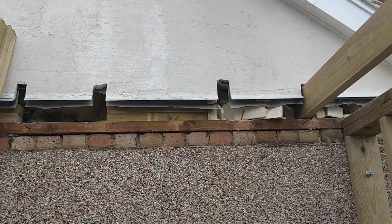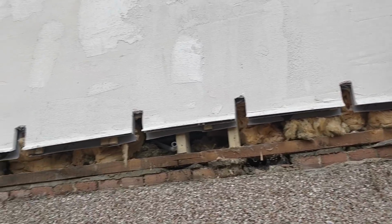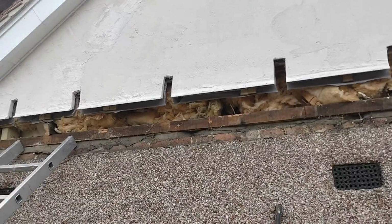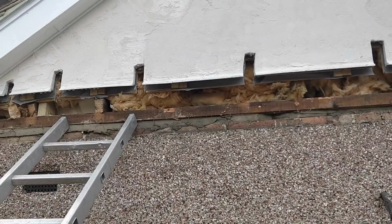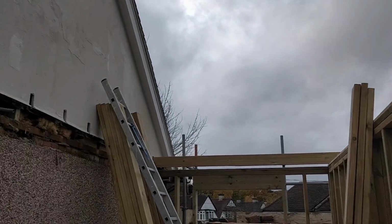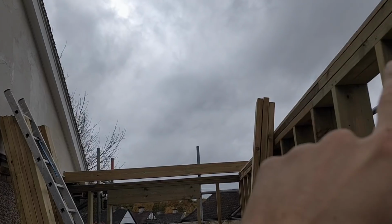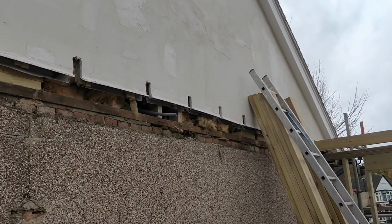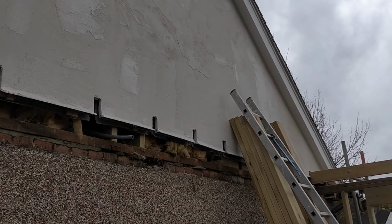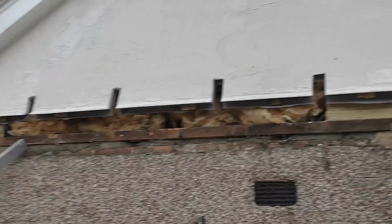Okay, right, that was obviously a big one there because of the wood, but all the rest of them are pretty evenly spaced out the whole way along. Again, I had to do a couple of big ones because of some of the supports that were just behind there, but there's plenty in here, and this isn't a load-bearing roof. There's tons of space. They're oversized. It's a short span, it's going to be absolutely fine. It's literally just to hold up some plasterboard and to hold some loft boards. And that concludes that portion of it.